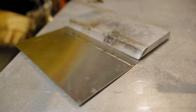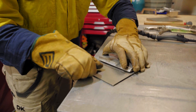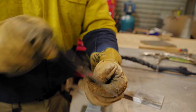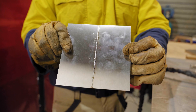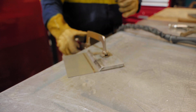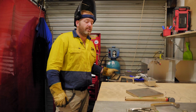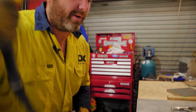Now what we do is fuse the other side. As you can see, because we've only clamped one side, there's actually a slight bit of distortion in it. But that's all right — for this application, that's fine. I noticed my amps were a tad low. Both the alloy below it and the alloy heat sink on the side is actually drawing a lot of heat out of the stainless, so that's why that weld was so small. I've just bumped it up to about 45 amps.